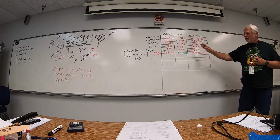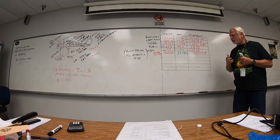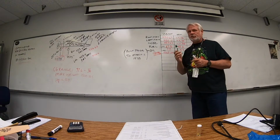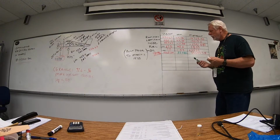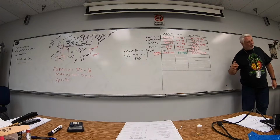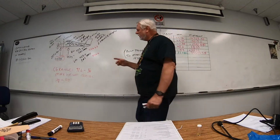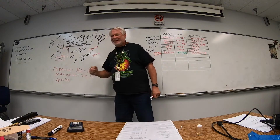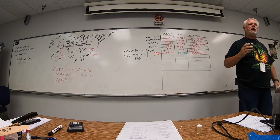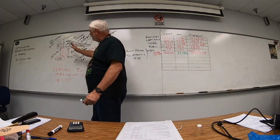So we've already taken out the oil, but here's what we're going to have to do now. We're going to have to establish some things. First off, if we do a forward CG check, which would be our first thing to do, typically, we're going to have to calculate anything that is forward of the forward CG limit. In other words, anything that is forward of 32.6 inches, we're going to have to calculate to the max. Because we're doing the worst case scenario with the aircraft loaded nose heavy.